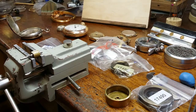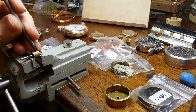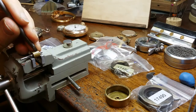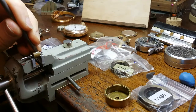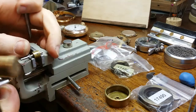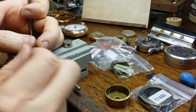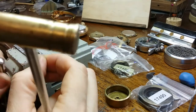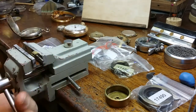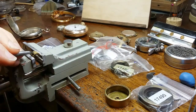I thought instead of using the slot that was filed in there, I would restore the barrel arbor hook. Every mainspring that I've ever worked on, the inner coil of the mainspring has a hole drilled in it which is caught on the arbor hook. So I thought it would be best to just restore this hook as opposed to bending that inner coil around and using the slot that someone else had filed into it.